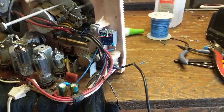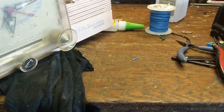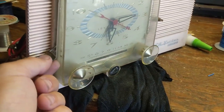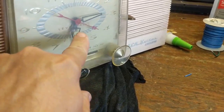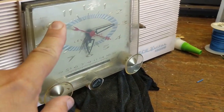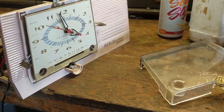The set is more or less completed. I've got some cosmetic work to do. I want to clean up some of this stuff here, and I'm going to use a toothbrush dampened with a little cleaner. Then I'm going to remove the knobs, dab a little clear polyurethane on these indicators — even though they look like they're in great shape — then polish the plastic, and then we can do a reassembly of the cabinet and install the switch.